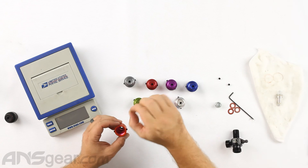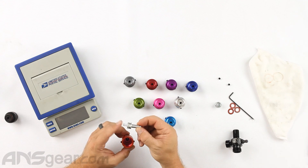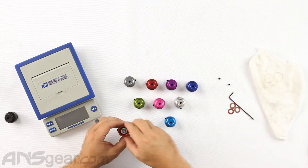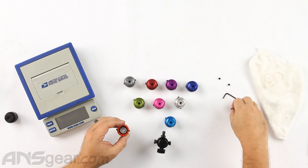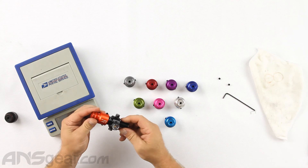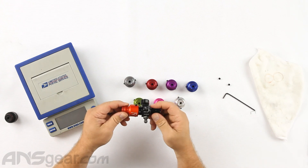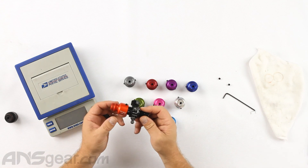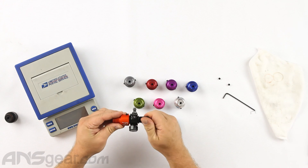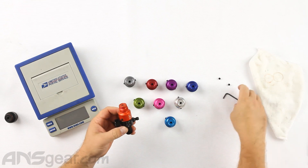Take our ball bearing and drop it inside. Once we've greased the inside of it, take our piston and make sure that your spring is in, then push that down in there as well. If we are shimming, we're going to take our shims, put them inside the bottom, and then screw it together. As you're screwing it together, if you feel the screws binding against the threading, do not continue — back the screws out a little bit more so that they do not get in the way of the threading as you screw it in.